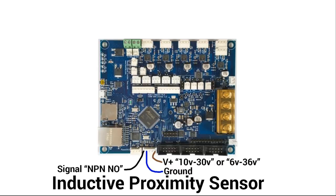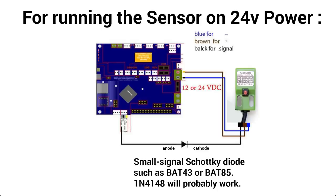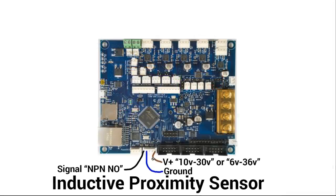For the inductive proximity sensor — the colors are a bit weird. The signal wire is black, which is usually ground color, but this seems standard for proximity probes. Make sure to verify your specific probe's pinout. The controversial thing here is that the voltage off this plug is only 5 volts, but the sensors call for 10–30 volts or 6–36 volts. It does work at 5V — I've got it working — but it works better at 24 volts where the sensing distance is larger. If you go the 24V route, you'll need a Schottky diode. I'm keeping it at 5V for simplicity in the rest of this video.